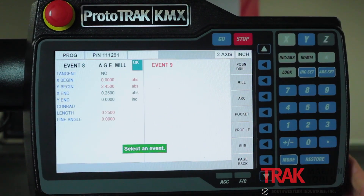Face mill is another new feature. Face mill allows me to describe a part by how long and how wide it is. Once I give it the tool diameter, it creates a serpentine path that will clean off the top of the part and complete the operation.